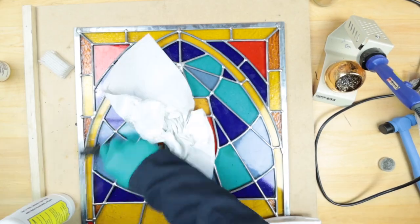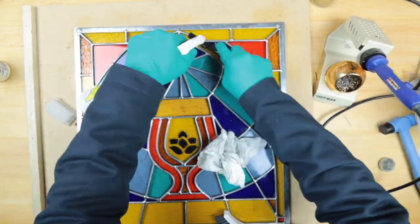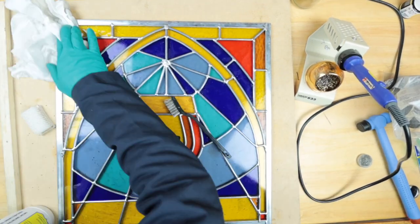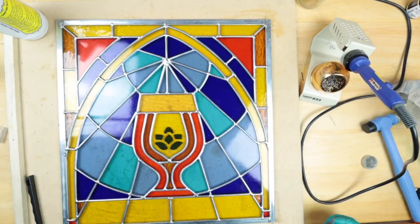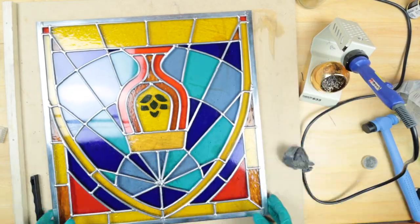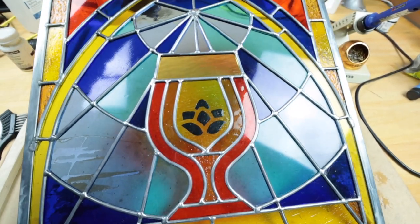After the soldering was complete, I cleaned the entire panel with quick clean to easily get rid of the flux residue, wiping with paper towels instead of the alternative of giving it a bath with soap and water. I also tried scrubbing the zinc borders with fine steel wool to even out the shine, but I'm not really sure if that did anything or not.